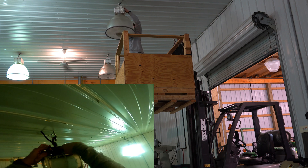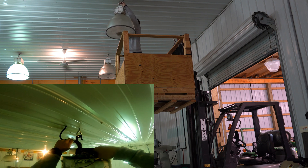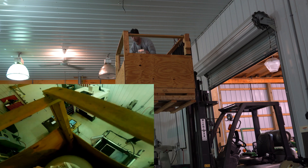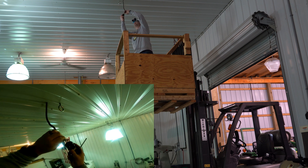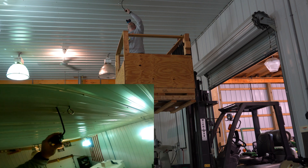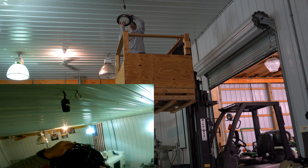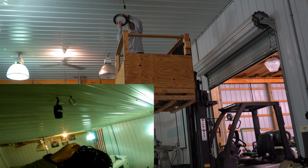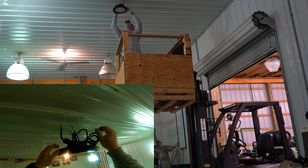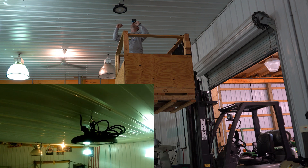I'm just disconnecting the old fixtures and popping them off — they're on an eye hook too, so it's pretty straightforward. Now we can lift this guy off. Since the existing wiring was just bare wire, we're putting on little connectors to give us a 110 female plug. Now with the plug on, we'll tuck the wire up a little higher in the ceiling and put on the new LED fixture. It's in there now. We have some extra wire we might cut down and shorten after setup, but this is a functional setup. Only took a couple of minutes.